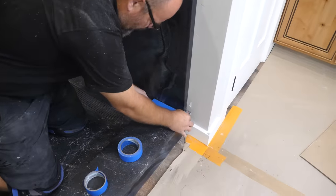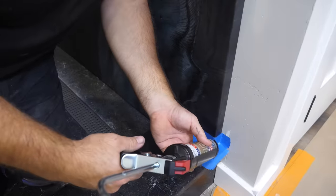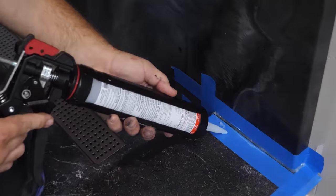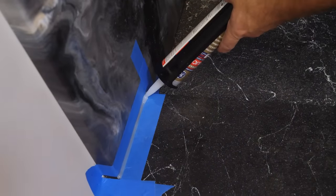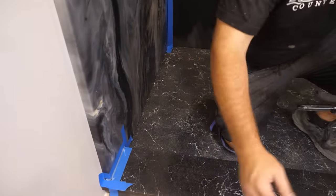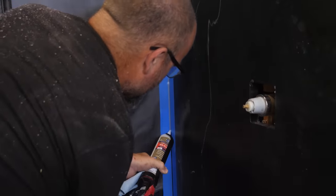Boy, that little partial roll of tape is done right by me. It's stretching it. And I'm just going down on the edge of this. Down the face a little? Yeah, just the threshold, not the foam. Okay. There's probably enough on your finger to go down the face, okay? And then I'm just gonna do one joint at a time. That way I have all the time I want to tool it. And then I'll start on that next joint after I peel this tape.